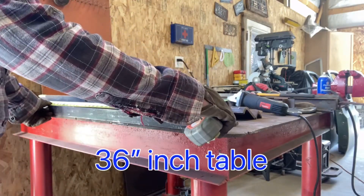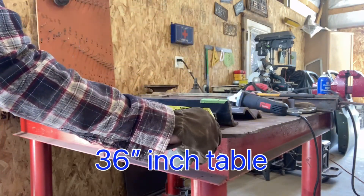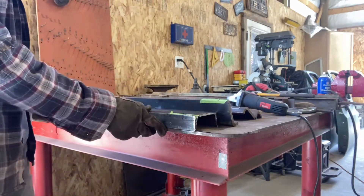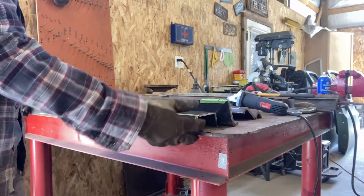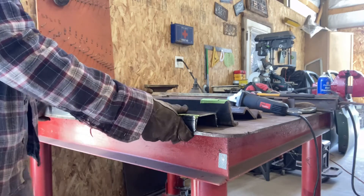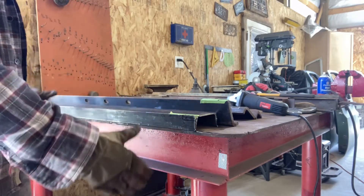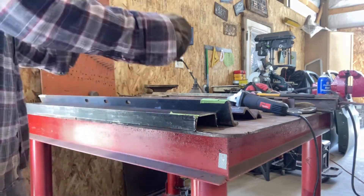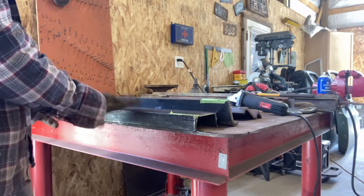So that'll be a 36-inch bender. I'm building it this way where I can mount it to this welding table, but also later I can take it off and actually put it on a base when I get to that point. This table is so heavy it'd be really good to fold metal on - it's not going to move. As opposed to a base, if you get that heavy metal with just a base platform, it might try to pivot and rock around and slide around. So I'm building it this way for now for that reason.